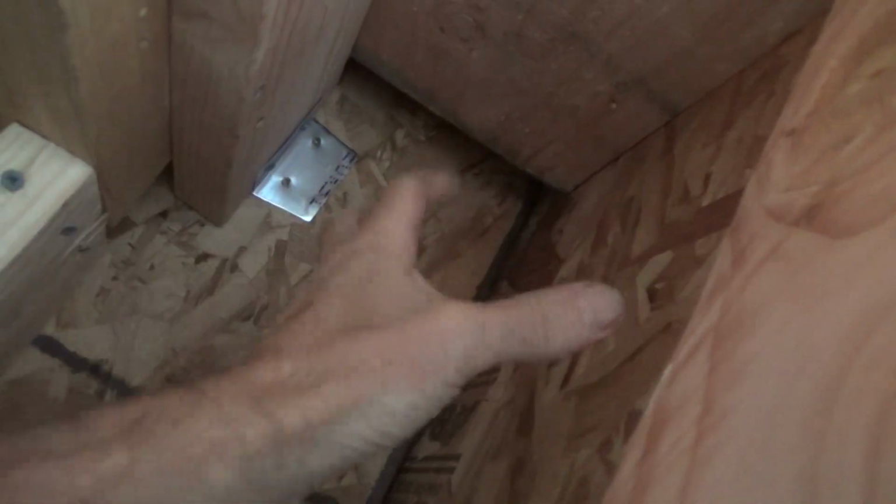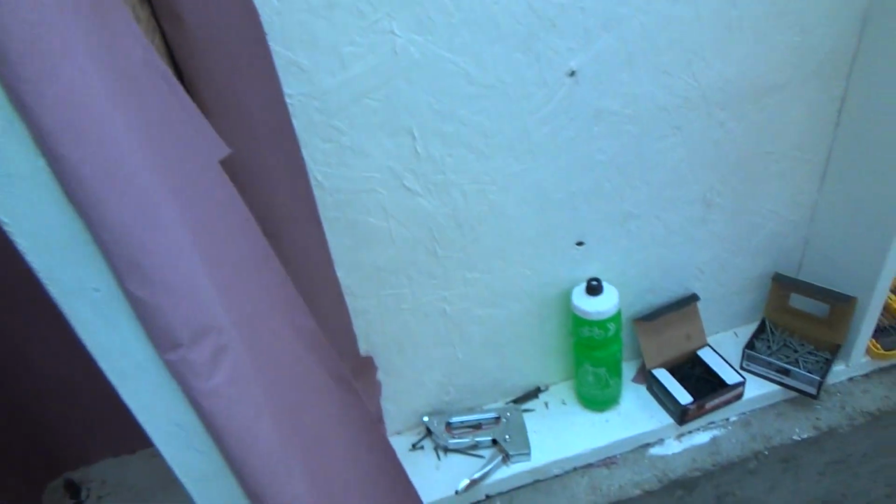And I can do the same thing over here. See, once I take this brace out for the stair, before I do that, I'm going to cut a 2x6 and fit up in here, up underneath there, put it in there, and get it all taken care of. Okay. So I got a little bit of work left to do.